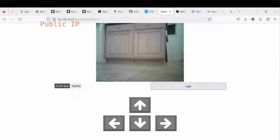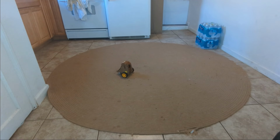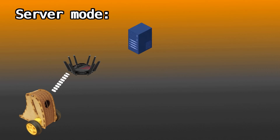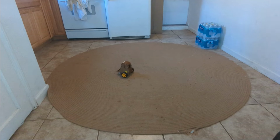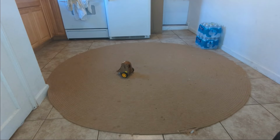So, the next step is to go between this AP mode and the server mode from my previous videos. For those curious, the BallyBot server mode is built on top of the ESP32's station mode, where the board connects to a router for access to the internet, like a normal computer this time. After this, it looks for the server IP to form a WebSocket, and the server relays that information to any subscribed clients. In other words, the laptop. So my last big step is to make it so that the BallyBot can switch between the AP mode and the server mode and change the way that it's configured in the network.